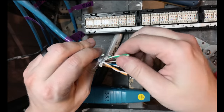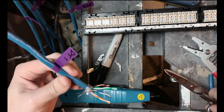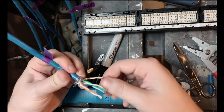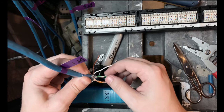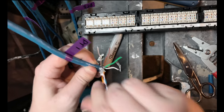Here I'm just going to finish getting rid of all of the shielding. I am going to keep the ground cable — that middle one — and just wrap it around the jacket. I don't really have anything to terminate it to since the patch panel we're using is really only meant for Cat 5; it is not meant for Cat 8, but that is the cable I decided to run.